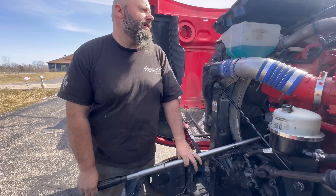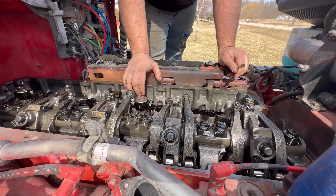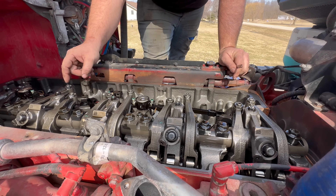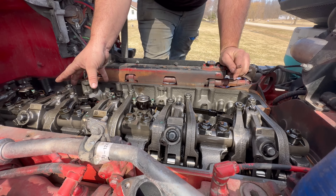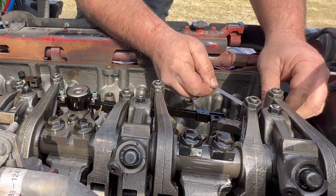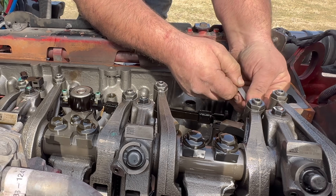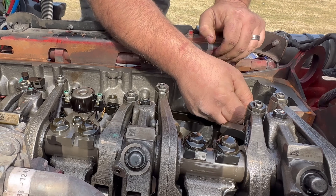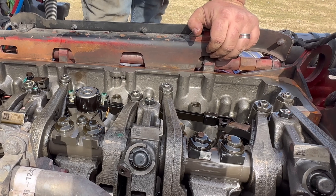It's on compression. One tricky thing I want to mention - these are your exhaust, the shorter ones as you can see. Because when you're over here and you go to number three, it flips this way, so you've got to pay attention. This is our intake, our 14 thousandths. A lot of the times you got oil underneath there - so we are tight, it won't even fit.